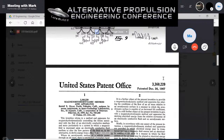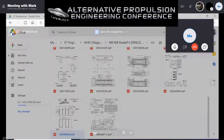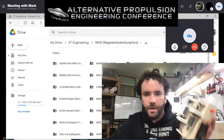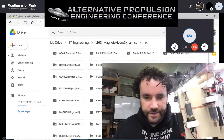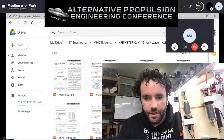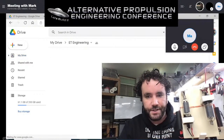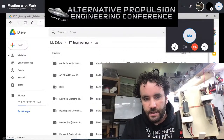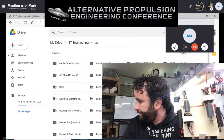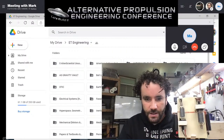I'm going to share the screen for a second and show you guys what exactly it is I'm working on. Oh, excellent. Hold on one second. Okay, so we have these two tubes that were set up with their own little power supplies. Unfortunately for this experiment, these power supplies are not sufficient to power the coil. So I'm going to be disconnecting them from the circuit, but still leave them attached. We're going to use these rectifier tubes to isolate the power supply, which is going to be our 125,000 volt Gamma High Voltage research power supply over there. We're going to hook these up in series, so we have double the isolation.